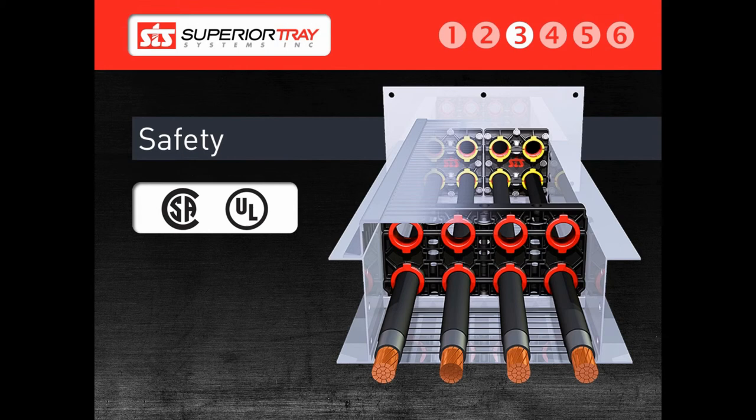Unlike a cable bus, a bus duct system may require forced air cooling in order to cool the conductors for high-ampacity systems. The next section is safety of the cable bus. We carry full CSA certifications for the cable bus, UL certification for the grounding conductor, so we can be installed in the United States. This, with our stringent quality control, guarantees the safety of our systems because they are reviewed regularly by outside code bodies. Our certifications guarantee that customers will always receive a high-quality product.